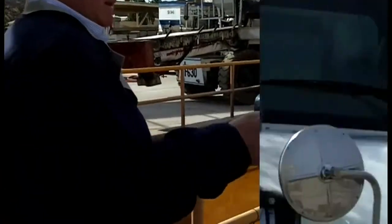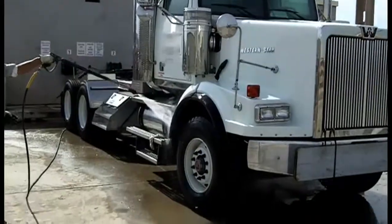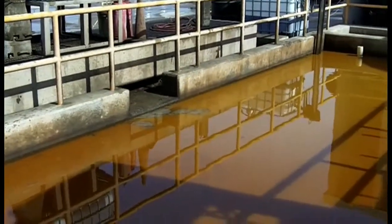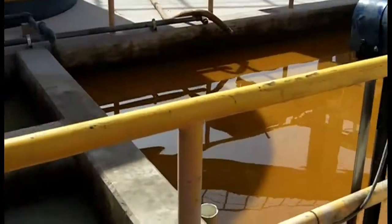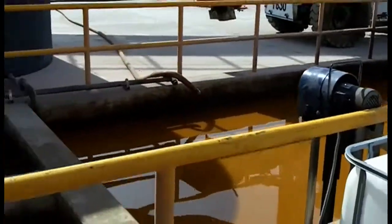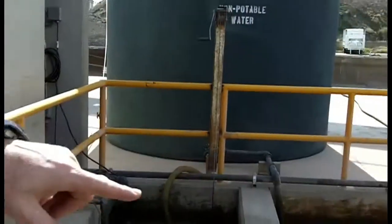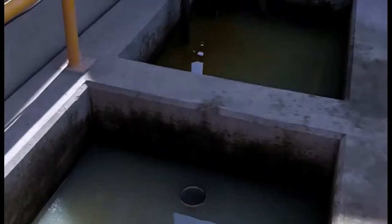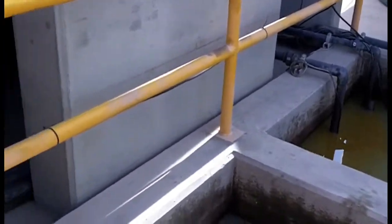We've got wash pads on the right and the left that feed into a clean-out pit. We like this style of clean-out pit. This particular company uses a chemical that's based as a treatment for concrete. And you can see coming into this pit, the difference is amazing. You can see we take it out with a belt skimmer and that's connected into a tote tank here. It's concentrated in this tote tank and then they take that and reuse that product. From here it gravity feeds into two more stages — it runs through the clean-out pit to the first stage and the second stage. Then it's going to be pulled inside to our treatment equipment and we'll go in there and take a look at that shortly.